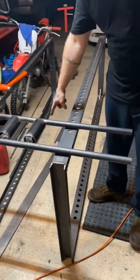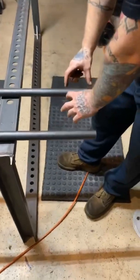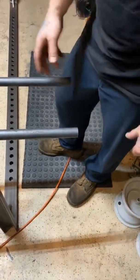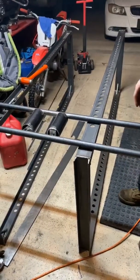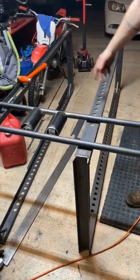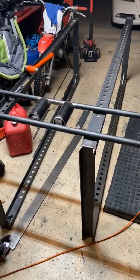I'm going to use more of that flat on the ground, cut it into little squares, weld directly to the hot roll, and drill and tap it. So this thing will be completely where I can unbolt it, take it down, and move it — essentially just a three-piece rack. So there it is, there's my update.